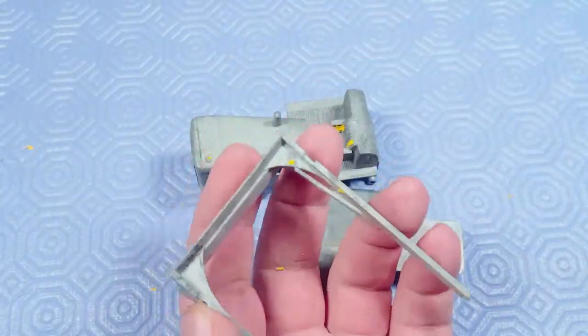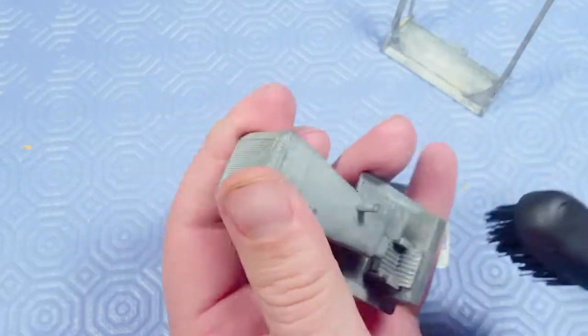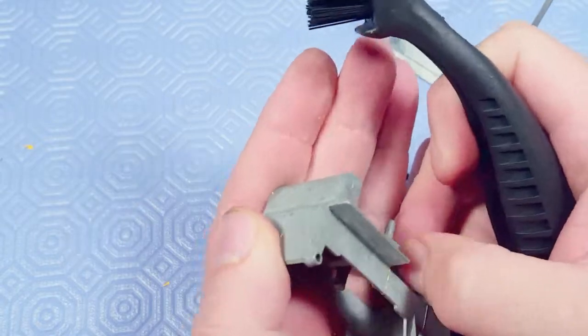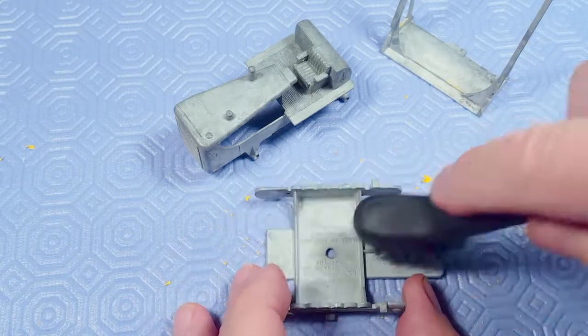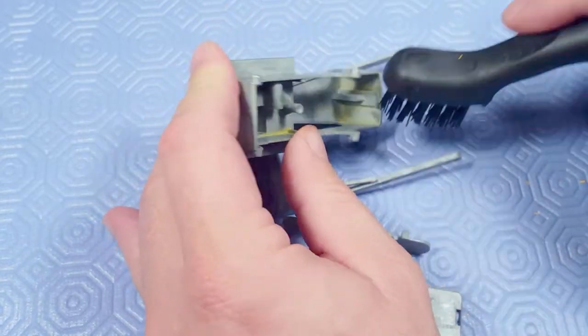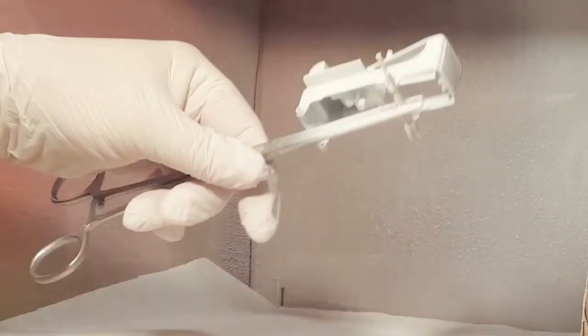I bring it back inside — there are just little bits and pieces clinging there but they're basically destroyed. I'm using a plastic bristle brush to get them off. On this one I don't go in with a wire brush because the casting looks really good, and to keep that rough surface I think it's better to hold the paint. The casting is really good — they painted over the original paint — so I'm going to leave it rough. I didn't do any buffing of the material because it's going to hold the paint better when it has that texture.